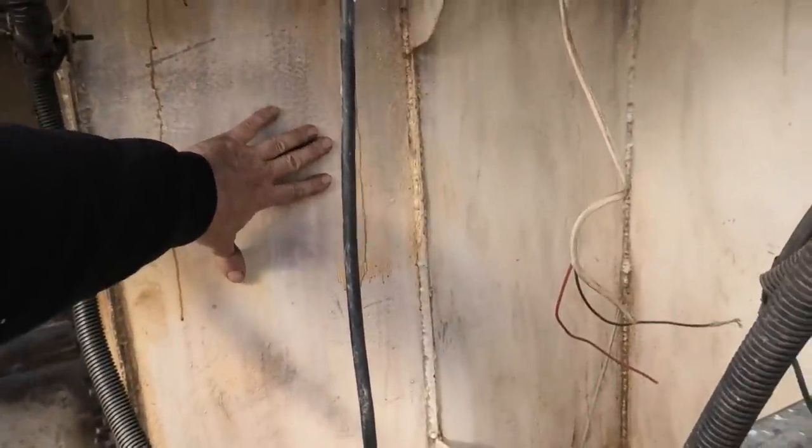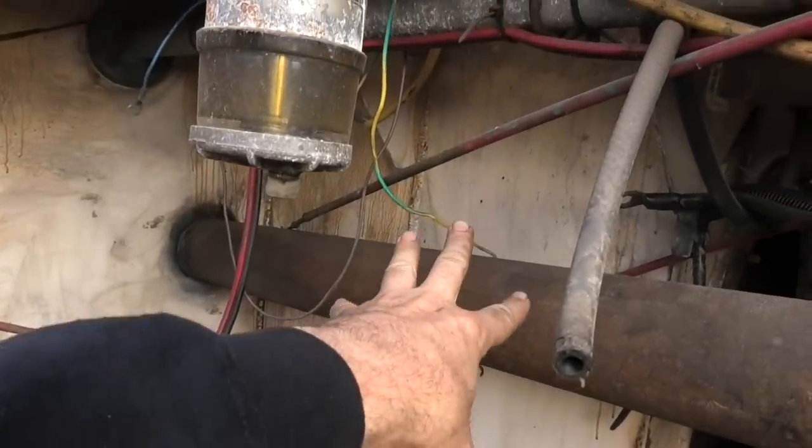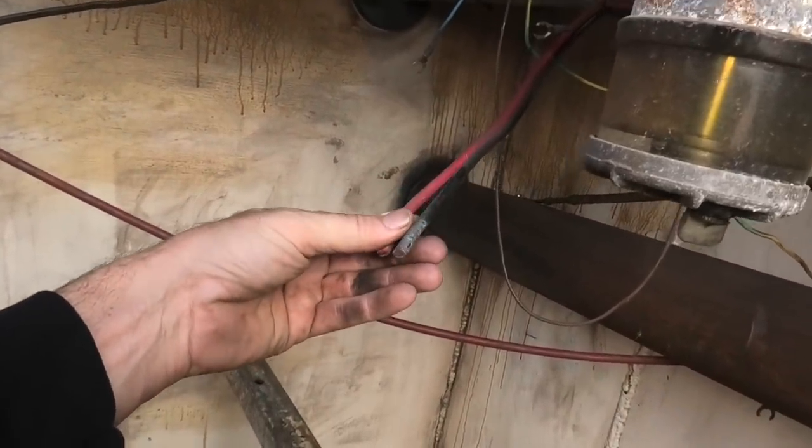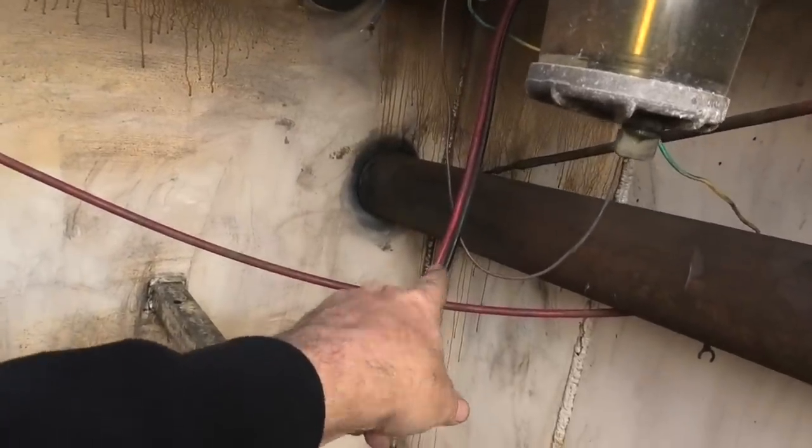I'm having a bit of a think about where to mount the electrical panel and I'm starting to think I might actually make two. I originally was going to put them on this side because the wet exhaust blocks the other side, but we're taking that out. These two cables are the main power feed to the wheelhouse — they'll reach that side just fine but not this side. I've actually got quite a lot of electrical stuff to install, and I'd rather have two themed boards than one really crowded board. One could be dedicated to charging and current coming into the batteries, and the other for all the circuit breakers and bus bars — current coming out. So I might make up four more brackets tonight and look at putting a board on both sides.